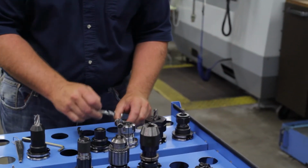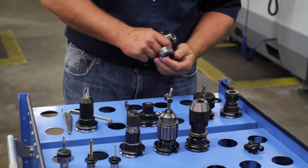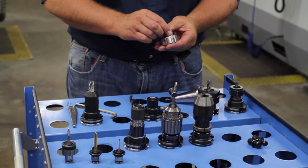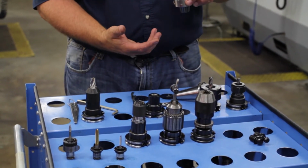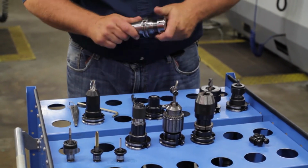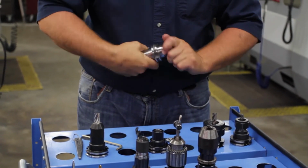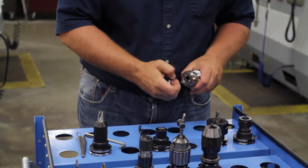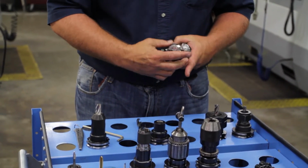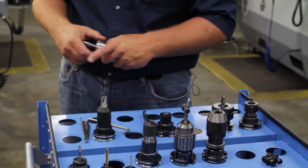Okay, the other collet system that you have is what they call an ER32 collet. Here too, you want to snap that in there, okay? And then that doesn't come out. So I'm going to go ahead and tighten that up, get that started. And then you would go onto your vise and go ahead and tighten it up just like you did.